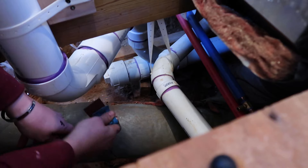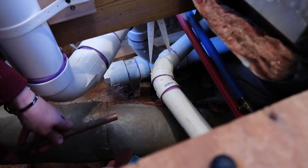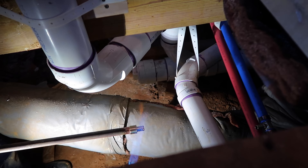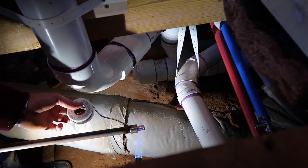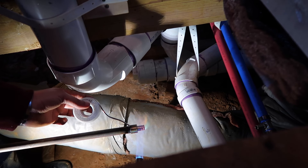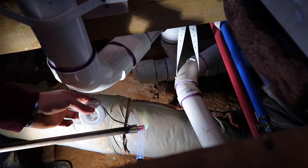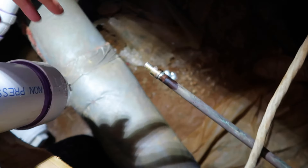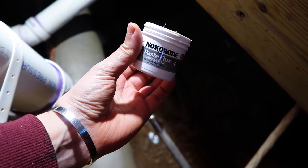It is time to solder on some of these copper pieces so we can connect to the PEX that we just installed. This is also the first time I've ever soldered any fittings together, so hopefully we're good. We were having some serious technical difficulties because we were using water-soluble flux, which doesn't work well with this connection — at least it sucked for me. It's got to be hotter, and then it was melting by the time it was hot enough, so it wasn't working. We ran real quick to pick up some different flux and it worked first try.